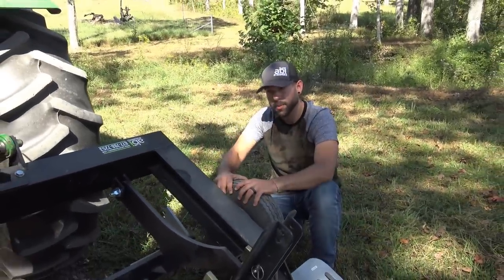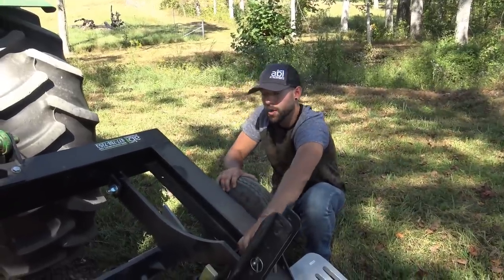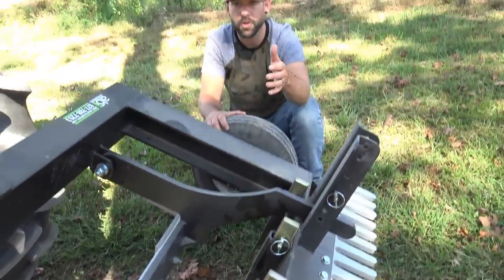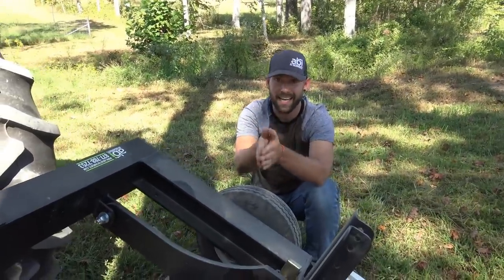You've got your stabilizing wheels here to make sure that you don't rip deeper than you want to rip. We've got our scarifiers, which is what we call our ripping teeth. They're out of play here, but you see the four different holes that allow us to drop those down and rip 4 inches deep. This is crucial for all of you working to plant any kind of seed.